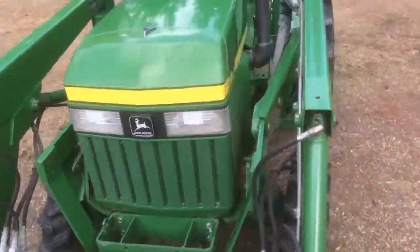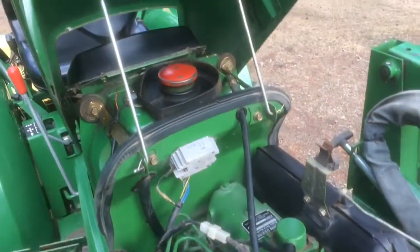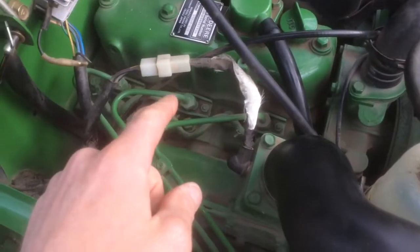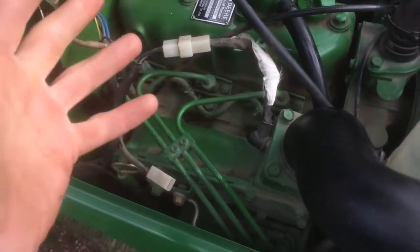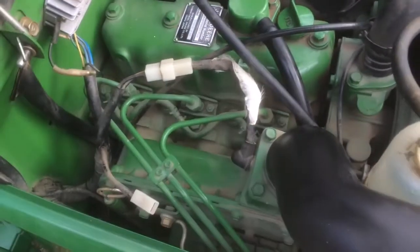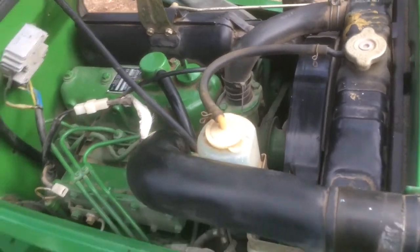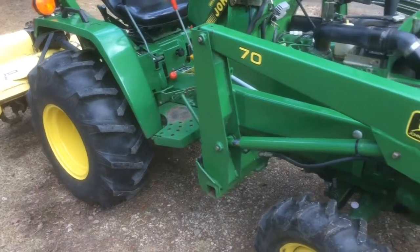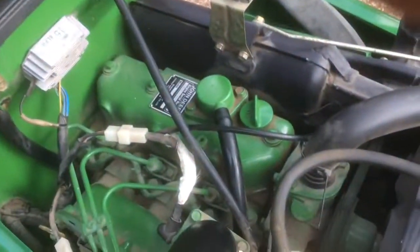Here's the engine compartment. It's a three-cylinder diesel Yanmar, 1.4 liter, so it's a little bit bigger than all the new ones like the 1025 and the 2305 — they're all around 1 liter or 1.1 liter. It's rated for the same horsepower, 23–24 horsepower, but it's a little bigger engine. Being a heavier, all-metal framed tractor with more substantial wheels, it can certainly push more than my new tractor — but no cab, so it's cold in the winter.